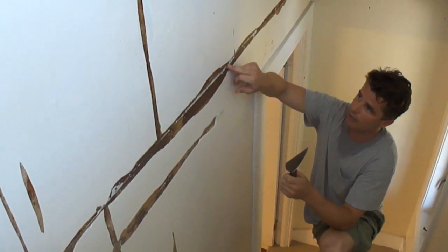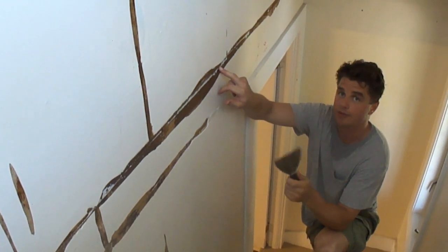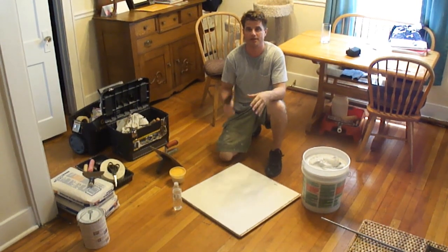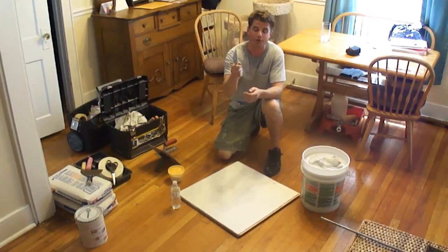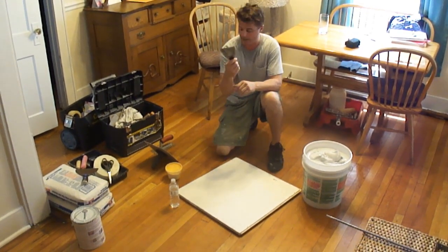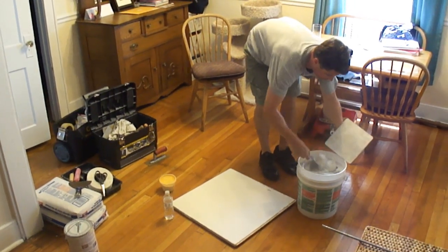So these gaps here are probably like a quarter of an inch. So before we tape them, we're gonna have to pre-fill them. So if you can follow me into this room right here, we're gonna make a mud pie, because when you mix the two together, it dries in 10 minutes. So we're gonna pre-fill them, and then 10 minutes later, we're going to tape it, and then after that, we're going to skim coat. So I have my 4-inch blade here, and I have regular all-purpose joint compound in here.